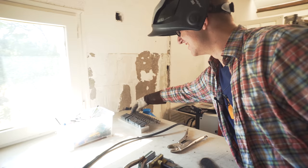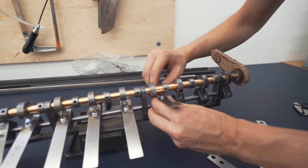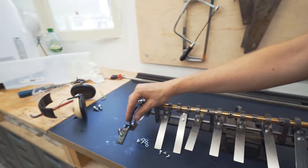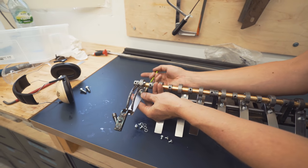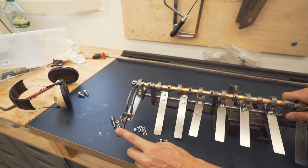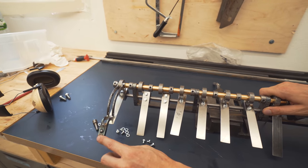I am working with these spring steels for the vibraphone - I made 11 of them. Why spring steel? Because over here I can tighten this set screw in the back and then I can adjust the spring steel to a certain position, and then we can have this spring action so the vibraphone plate can move.